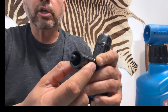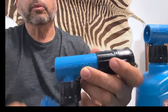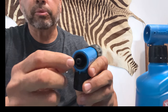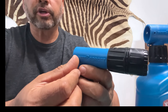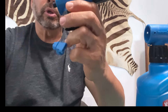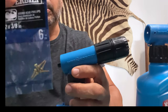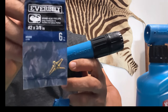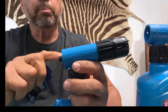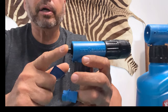So you could put a hole on each side of this without affecting the performance of the nozzle. What you need to do is drill a small hole on this side about a quarter inch from the front, another small hole on the other side a quarter inch from the front, and put a small screw in each. I chose brass screws from Home Depot — number two screws, 3/8 inch long.